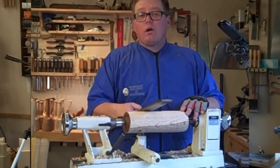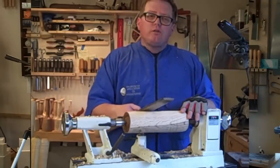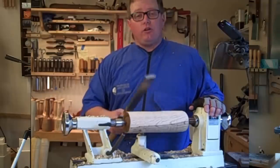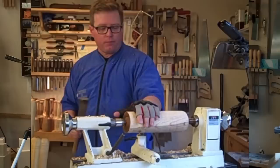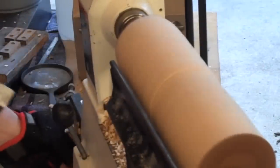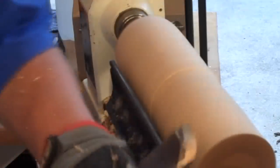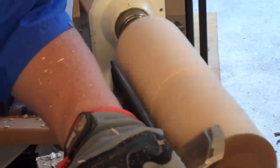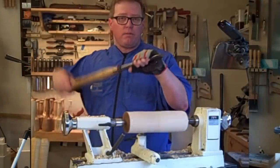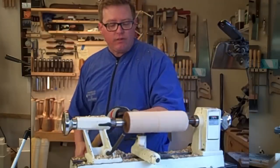This is the main tool for making chair rail, banisters, or legs — like for a rocker chair. All those can be done with a skew chisel. This is the main spindle turning tool, and you can do a lot with it fast. I ride the bevel, I lift up — that bevel will always be cutting the wood. I can control how much wood I take off by the angle of the back. As long as that bevel stays on the wood, I have ultimate control, and I let physics handle all the effort.